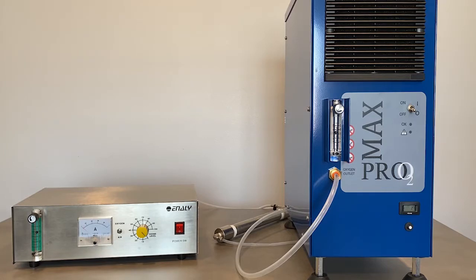Before starting the 5000BF ozone generator, we first have to start the MAX 5 oxygen concentrator, which will be providing our supply of oxygen to produce ozone. You can notice the green flashing light underneath the on-off switch. Once this green flashing light turns into a sustained green light, then we know that the oxygen is efficiently being produced into the ozone generator.